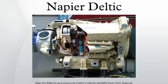The New York City Fire Department used a Deltic engine to power their one-of-a-kind super pumper system, a very high volume trailer-mounted fire pump with a separate tender. While the Deltic engine was successful in marine and rail use and very powerful for its size and weight, it was a highly strung unit requiring careful maintenance. This led to a policy of unit replacement rather than repair in situ. Deltic engines were easily removed after breakdown, generally being sent back to the manufacturer for repair, although after initial contracts expired both the Royal Navy and British Railways set up their own workshops for overhauls.